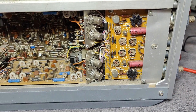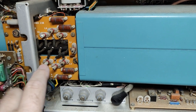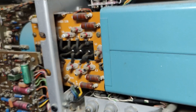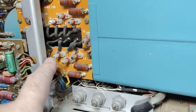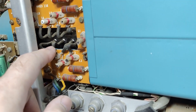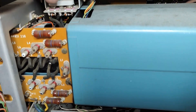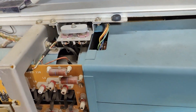That is interesting. And what I also see here will be the vertical deflection plates. Look at that — this is a transmission deflection plate system. Because this scope is really, really fast, they are driving the deflection system with a special impedance along the way so that you can handle the plates at a much higher speed. That is definitely interesting. I think this is the horizontal deflection amplifiers up here, and they are placed very, very close to the plates as well.